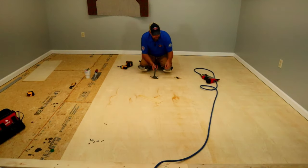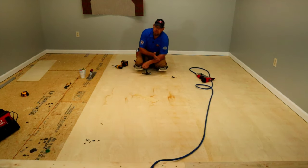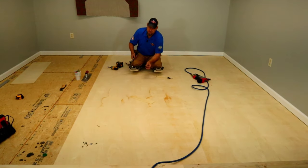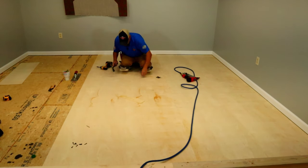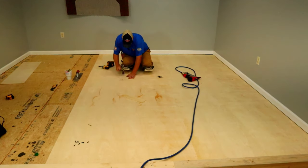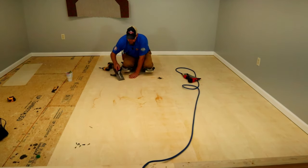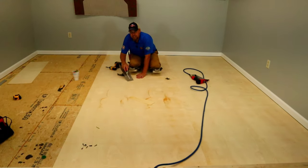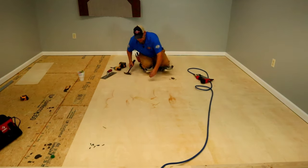Stapling is definitely the way to go. I'm going to drive a couple of nails and shoot a couple of screws to demonstrate what happens to your floor whenever you nail or screw it down. It might look nice and pretty and you might feel like it'll hold — I'll even put them in the proper four-inch pattern. If you can take a putty knife or trowel and rake over it and hit a fastener, you need to give it another hit. I've sunk them in there below the surface so the trowel won't catch them.